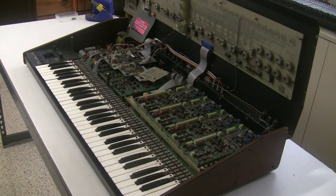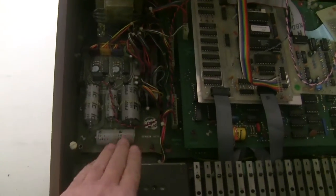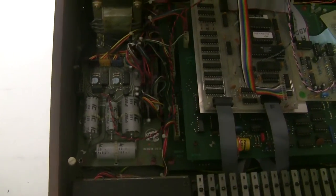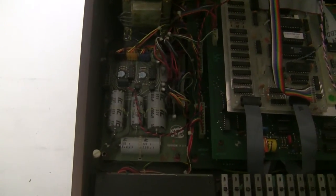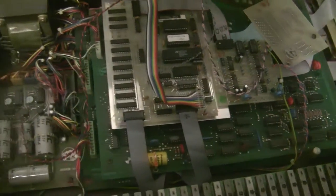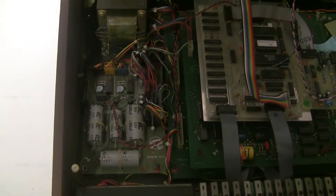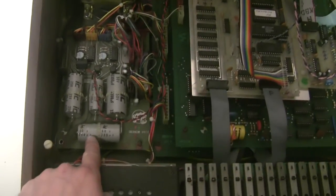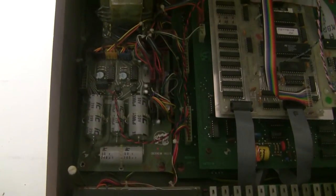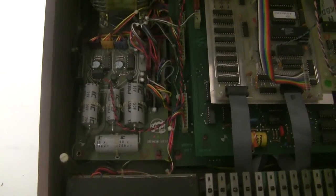The first thing you should do when repairing any synthesizer is to recap or rebuild the power supply, and that's where we'll start. The power supply is this board on the left side of the synthesizer. Fortunately on the OB-XA it's a separate board — on later models like the OB-8, the power supply is actually built into the microprocessor board and is more challenging to get out. So in this regard the OB-XA is more serviceable than the OB-8. In order to service it we're going to have to pull it out, and there are a whole bunch of connectors coming off of it.